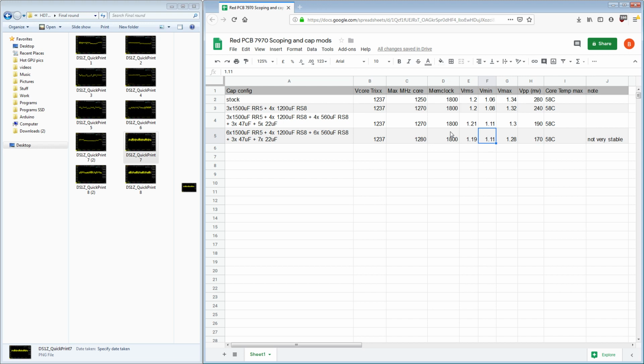So the minimum voltage, if we set the VRM to output a voltage of 1.237 volts, then our minimum voltage at 200 amps output current, assuming a 1 milliohm load line, should actually be, no, should be 0.5 milliohm. Yeah, okay, I had a mistake in the math. If it was 0.5 milliohm, then it should be drooping all the way down intentionally to 1.137, right? Because 200 amps times 0.5 milliohms is 100 millivolts.